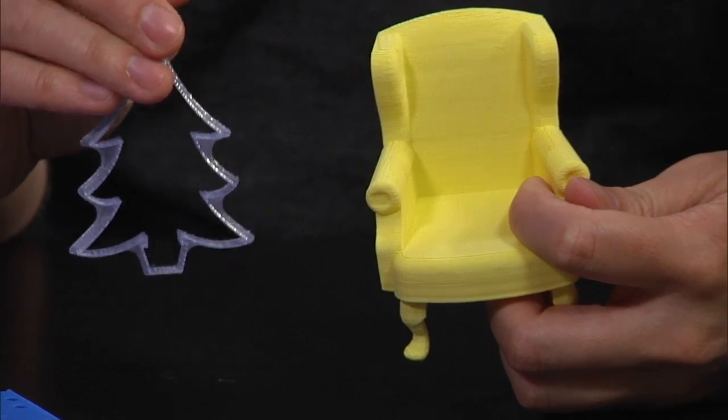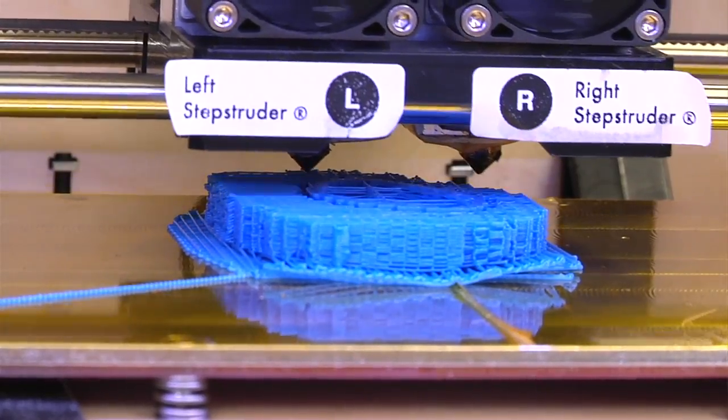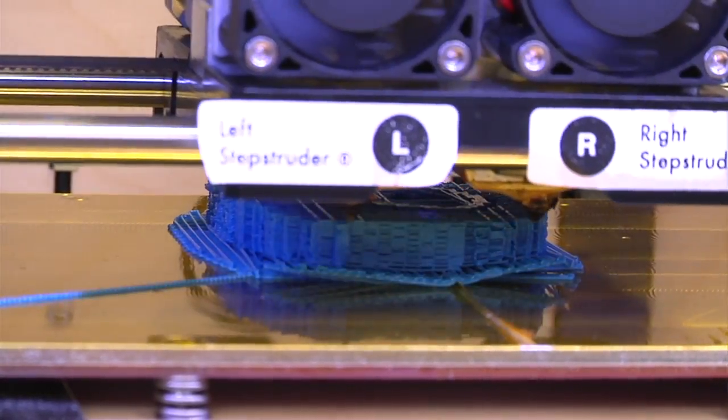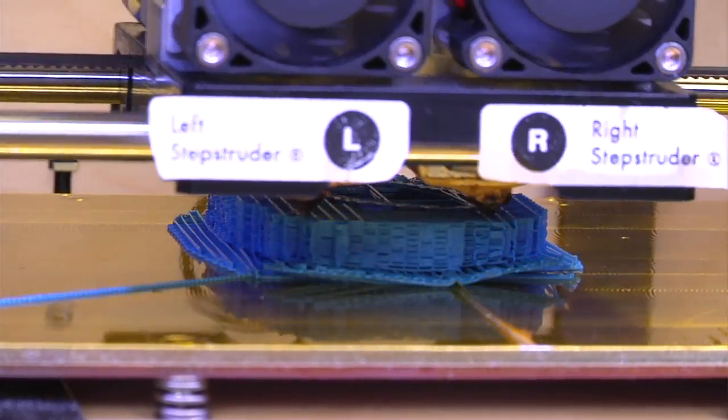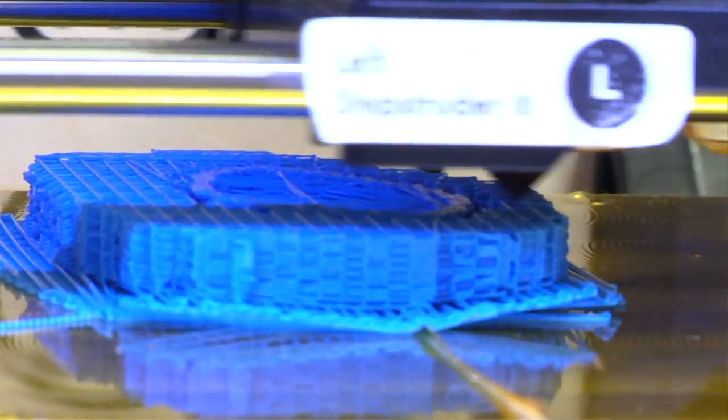And then with both types of plastic, or any material right now, it's heated and melted, from spools, so the material you buy in spools. Yeah, so the extruder is really, really simple. It is literally a hot end, a thing that gets to 200 degrees Celsius, and a motor with a gear on it that grips into the edge of a piece of spooled plastic and forces it down to that hot area. What that does is reduce the amount of plastic that comes out at any given time from 1.75 millimeters, which is the diameter of the plastic going in, to 0.4 of a millimeter.